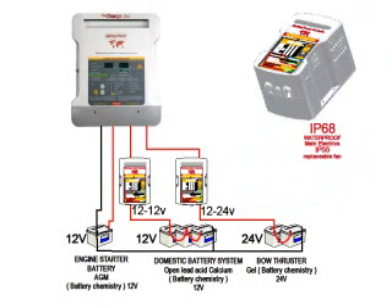So how do we fix this problem? The new Stirling module approach comes from a unique angle. We effectively place a built-in voltage booster into the output stage of a multiple output charger. This means the new device can be added to any of the output terminals of the ProCharge Ultra or most other competitors' products, as long as they are multiple output chargers. This allows the main charger to be set at a lower chemistry voltage for gel, and then by adding the new Stirling multiple chemistry module to one of the outputs you can adjust it to a totally different charging chemistry profile.